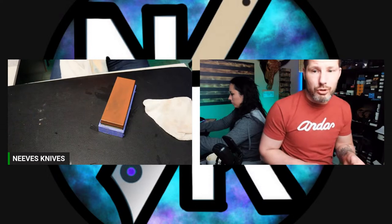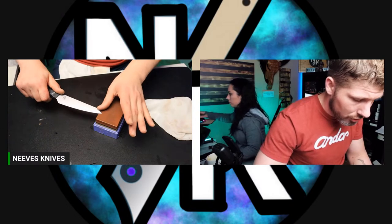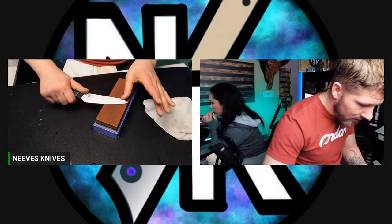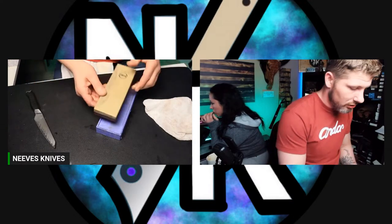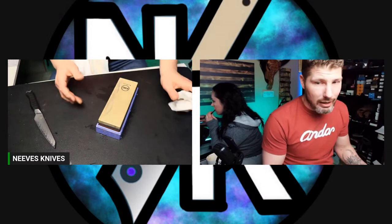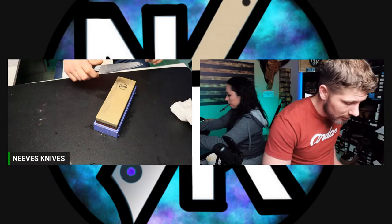So now we're going to do a deburring process, okay? Usually, like I said, I do edge leading or edge trailing. So I'll go like this. Now the point of this, let me explain, I'm going to flip it over to this other side. The point of this is to knock the burr off. You don't care about getting scratches on the edge.